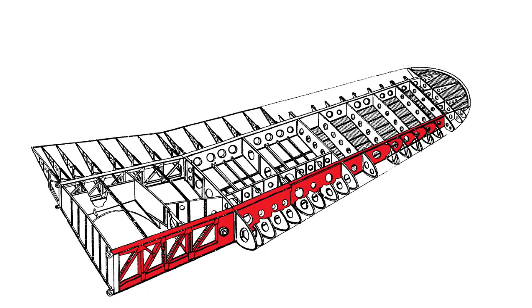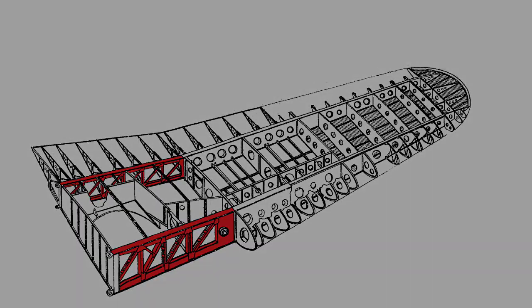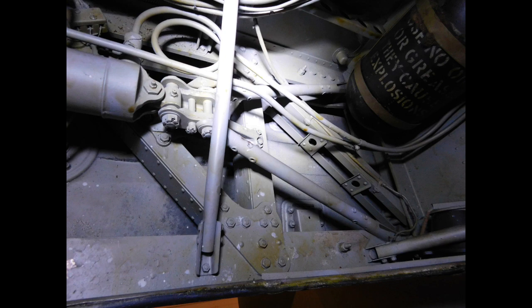The wing is fairly standard in that it bolts directly to the fuselage — different from the Hawker Hurricane's dihedral joint — and runs from root to the base of the wing tip with a forward and rear spar. The composite construction is visible in the spar makeup: they built the spars in a root section, a mid section, and an outboard section, both fore and aft. The root spar section is a very heavy end girder-type construction using upper and lower spar booms made from a double-T extrusion, with a warren truss system of channel section extrusions bolted with gusset plates — a very heavy load-bearing structure.